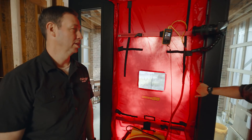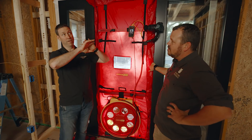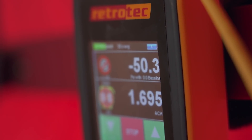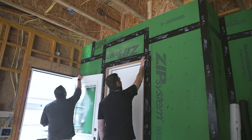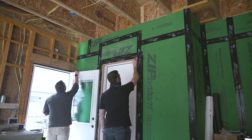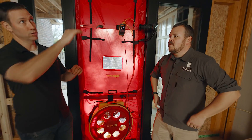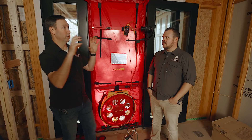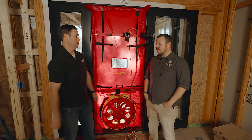A couple of takeaways. First of all, my house without my finished air barrier is at 1.7 ACH-50. Not as low as I would have liked, but this attached garage and the way it's attached is not frankly ideal, and it's not finished yet either. At Jake's house, he sheathed it with zip sheathing and then taped it to really tighten it down. His electrical was all applied later with conduit, treating the envelope as one box where everything outside the envelope gets applied after the fact.